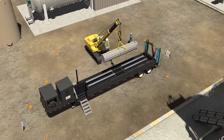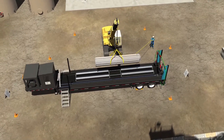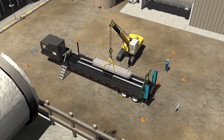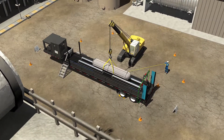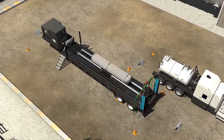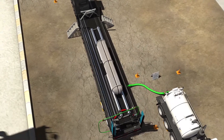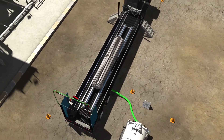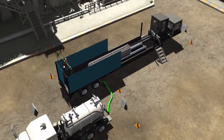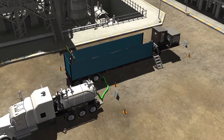For the bundle blaster to be utilized, the exchanger must first be removed from its operating position and placed inside our bundle blaster unit — the removal being completed by the client or another third-party contractor. A vacuum truck is then positioned at the rear of the bundle blaster unit, and the vacuum truck hose is connected to suction out the trough, which contains any debris washed off the exchanger. This unit allows the operator to clean the shell-side of the exchanger within a self-contained unit, removing the need for crews to clean the surrounding area.